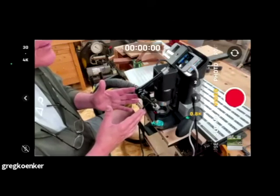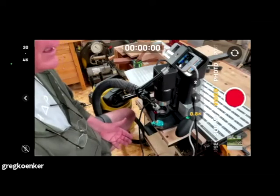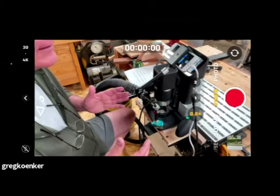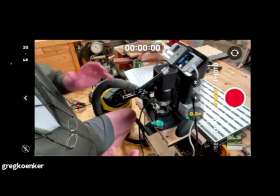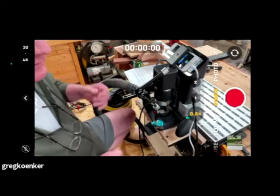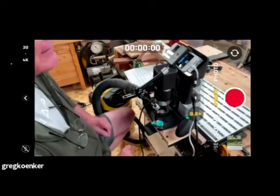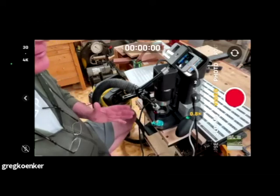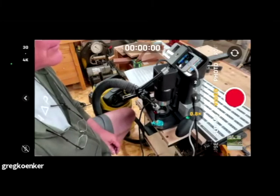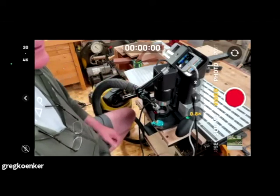Scale, doing big projects on this would be easier, or especially the idea of a floor. I mean, I guess you could try to take the pieces that are going to be next to each other in a floor, and attempt to cut them on a CNC machine, maybe even put them together temporarily and cut the pattern and so forth, and then take them apart, take them up and install them in the floor and then fit it, I guess. I don't know. But this, you take the machine up, you lay some tape down around where you want to do it, and you cut the pattern out and inlay the pieces. So you can do things that are already installed. You can take this to the site, I guess is what I'm saying.